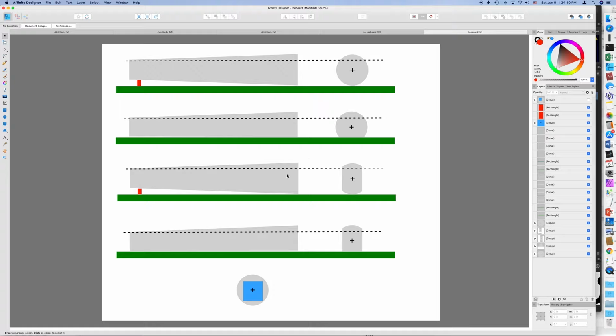Then we're going to rotate the log 90 degrees. And now we're back to having a round tapered edge of the log on the sawmill bed, so we again want to use our toe board to jack up the narrow end of the log to make the grain parallel in this other plane now. We'll make our cut there. And then when we go to make our final cut, again we've got a parallel cut down. We don't need the toe board here, so we make that final cut.